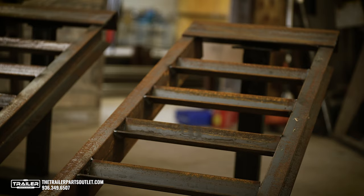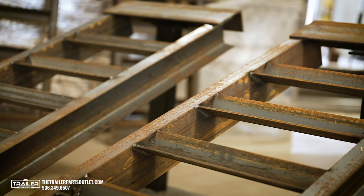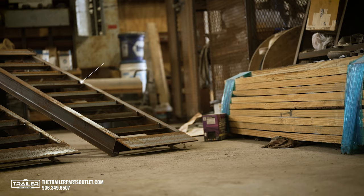Taking a closer look at these, you can see the angle iron uprights, which are constructed out of 4-inch angle iron. The steel has a thickness of 3/16ths of an inch. Along the sides, the runners are 4-inch channel and a 3-inch by 5-inch angle iron foot and lip.